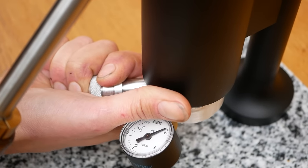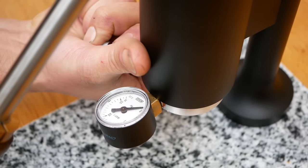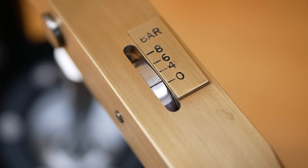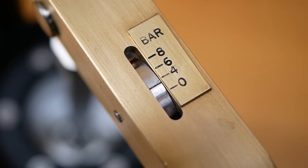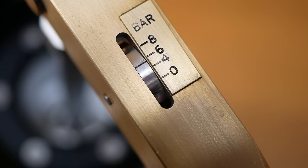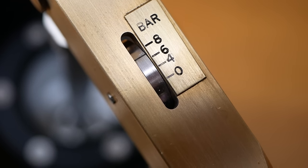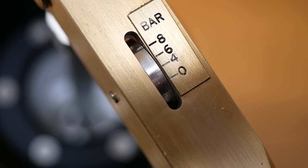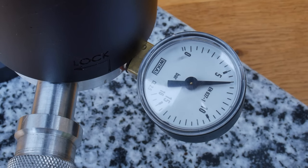On the Fulcrum machine the pressure can be read off the scale and the mechanism is neatly tucked away inside the hollow handle. The key benefit of this system is that no access ports need to be made in the cylinder for a conventional pressure gauge, which may result in leaks and stagnant water inside the gauge. A conventional pressure gauge also tends to be bulky and gets in the way.